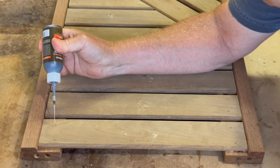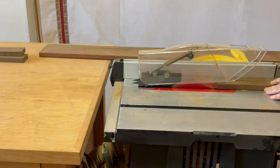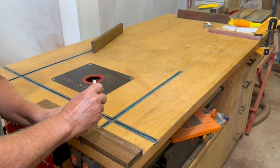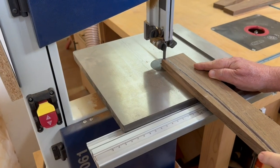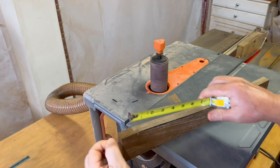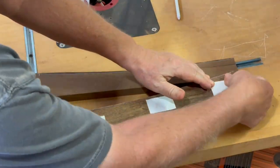I'm using a dark brown color CA glue just trying to hide the nail holes as best as possible. Moving on to make the seat of the bench. I want the seat to have an ergonomic curve to it and make it a comfortable place to sit, and I employed the same highly suspicious and random curve generator as on the cross members. After getting one of them to the shape I want, then I cut the other two, and then I do a final shaping with all three stuck together.